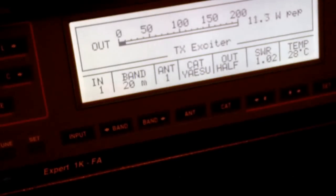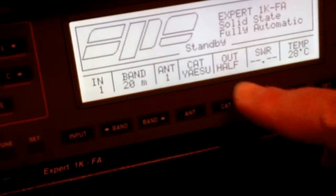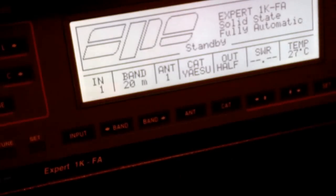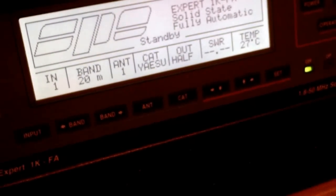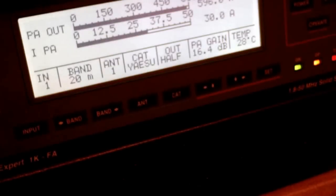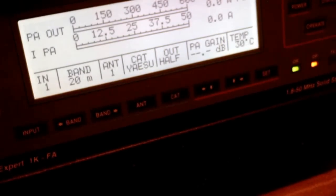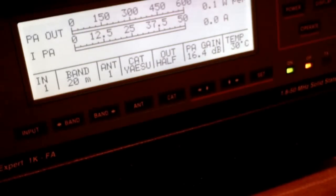I've got 10.9 watts PEP. To go into Operate — don't forget I'm only using half power because it is one kilowatt — leave it on half, and normally around 10 or 12 watts you'll get just over 400 watts; whatever loss you've got in your coax will work itself out. Press Operate — now it's ready to start operating. Key up and with 12 watts I've got 576.3 watts PEP, so that's what it's doing.